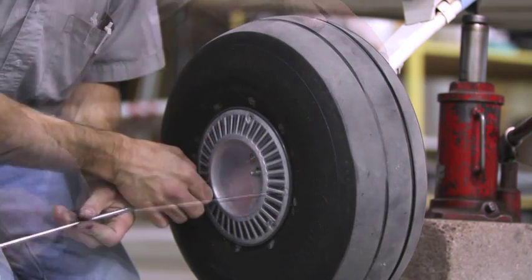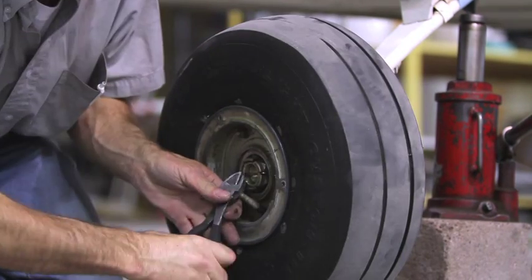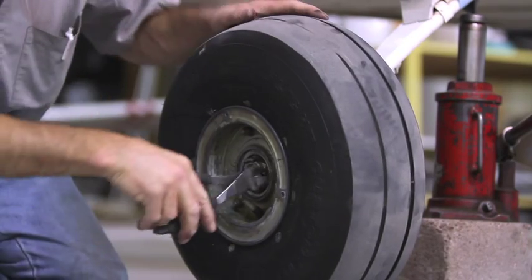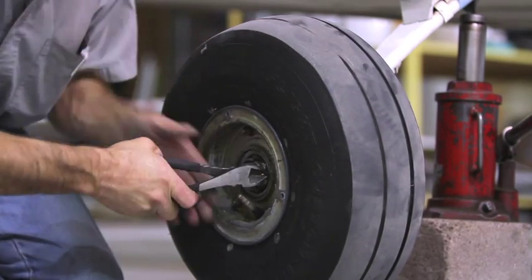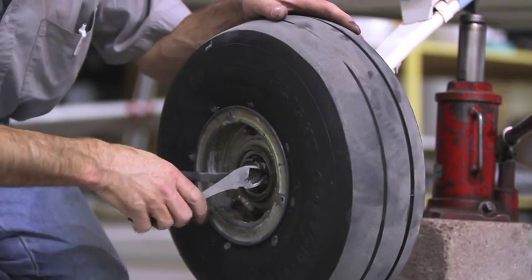There's a large castle nut behind the hubcap with a cotter pin that you'll have to remove. With a good pair of diagonal cutters, straighten the cotter pin as best you can and then pry it out. Be careful so as not to gouge the wheel during this process. In most cases you can pry against the nut itself rather than the soft aluminum wheel.